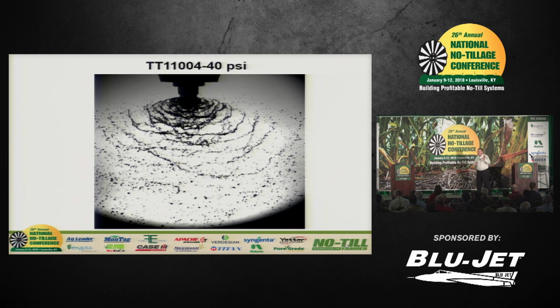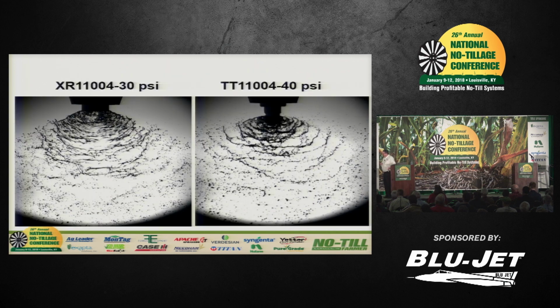Now, I don't have it in motion, but if you look, you'll see that there are fewer small droplets and some bigger ones. So the drift reduction difference here over the XR at a similar pressure would be about 16% less. So by the engineering design of this tip, if you changed it out with an XR, you'd have 16% less drift. And in all my research, I've never had any sacrificed coverage and efficacy. Okay, here's the XR. I guess I forgot I had that slide. There's the XR and the Turbo TeeJet side by side. You can see the difference in the droplets.